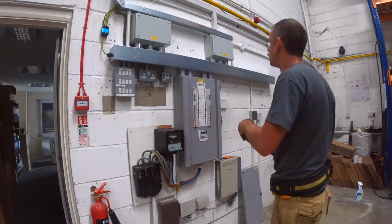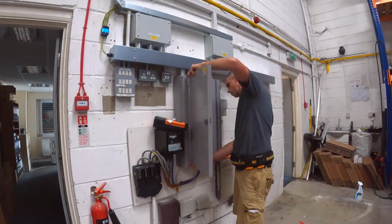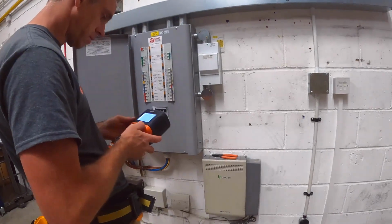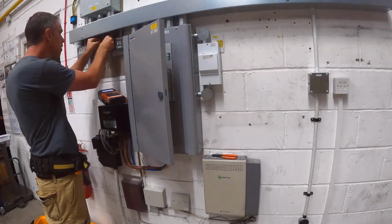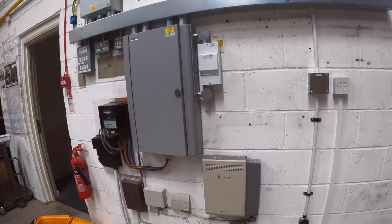Couple of little warning stickers on the junction boxes. The yellow ones are danger, 400 volts, and then the white label just says what it does, basically cable extension box or words to that effect. I like to put a circuit ID on everything I've done as well. So on the socket there, on that little junction box to the right, there's the fuseboard reference, the phase and the circuit reference as well. And lastly, the next inspection date sticker went on then.